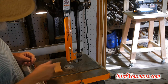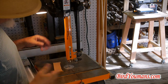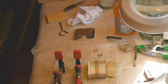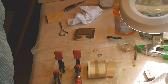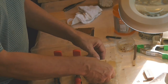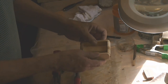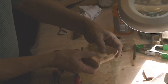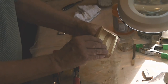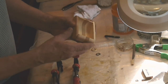Not the best solution in the world, but doggone I love the bandsaw — it's become my new favorite tool. Now that I was fortunate enough not to lose a finger, we got our front and back. This is what you wind up with — that's why we slice the back and the front off. Now you've got your cavity. When you go to glue that back together, voila — a neat little drawer, and all the wood matches. It's just cool.